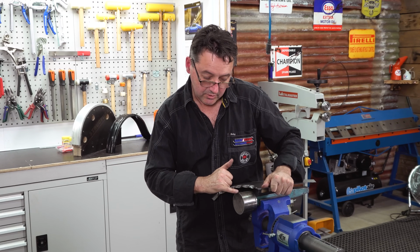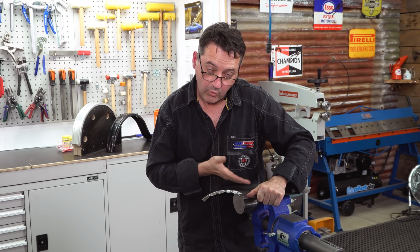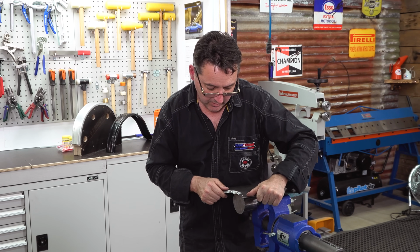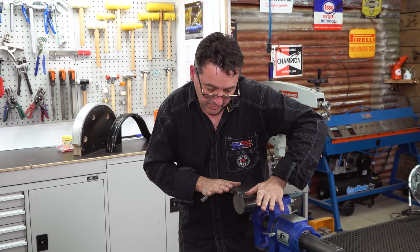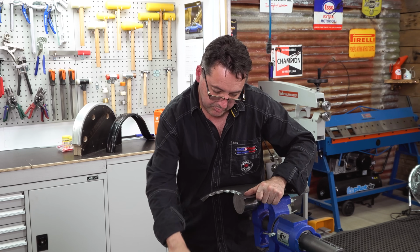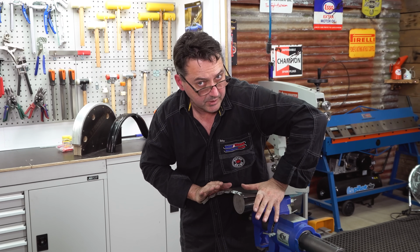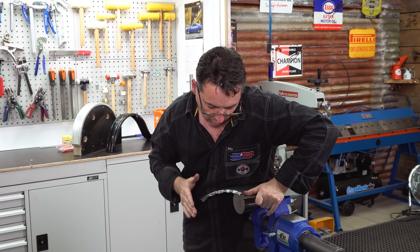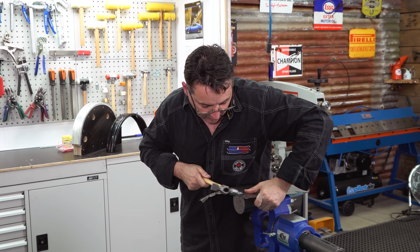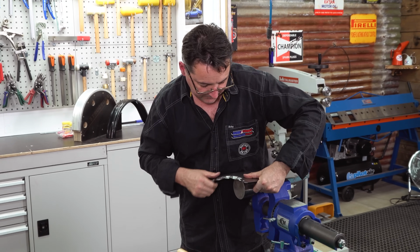Using the machined shoulder of our forming tool, place the corner or the edge of the sheet metal right in position over the edge of the turned round bar. We can then apply a little bit of downwards force. So there's two things that will happen. Number one, we're going to be planishing this front face, the vertical face. Number two, we also need to apply a little bit of load, just with your chest, or somehow or another, you need to leverage to get yourself in the right position. So a left-hander will come in from this side, a right-hander from the right side.